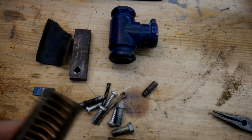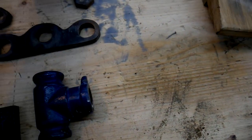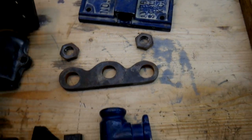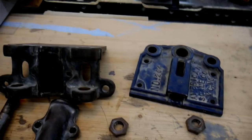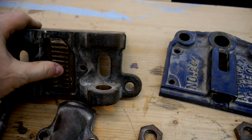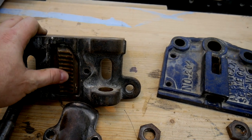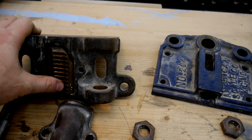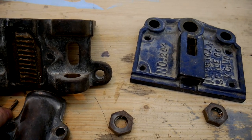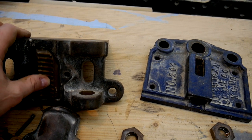that rubber in there. From what I could tell, the half nut rides inside that slot there, like that, and it's designed to slide back and forth inside here. And there's a little return spring that goes inside this half nut that helps keep it in this position. But it does have wiggle room.